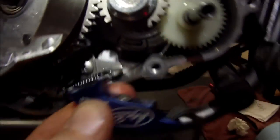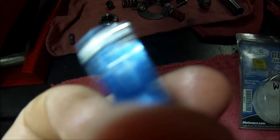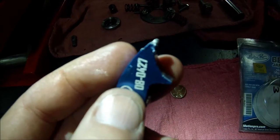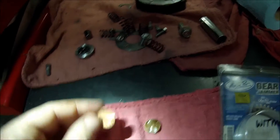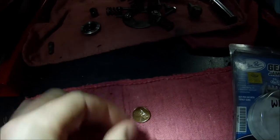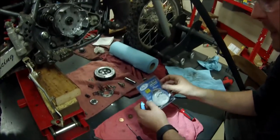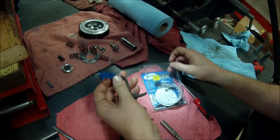There's good and bad about this — we found the problem. This tool gets jammed in between a couple sets of teeth, allowing us to torque a fastener down by jamming them together. This little magnet helps hold it on steel, but it's aluminum — a soft metal — and it's going to break or be abused over time, especially with as many technicians using it here at the training school. It's just obviously time for a new one. We also like using pennies — soft copper sandwiched between the gears.